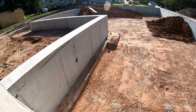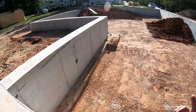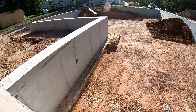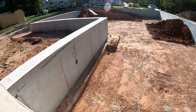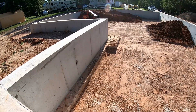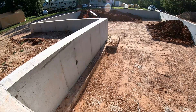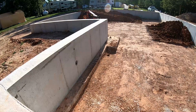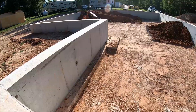And it takes, in this garage that I just worked on, 45 minutes per round. Well, this is three times bigger than the garage, so that means that we're looking at over 2 hours just to do one complete round of compaction in here, and we got to do it five times. So, yay. I'm pretty sure that I'm going to get sick of this just as quick as y'all are on video. So, I don't know how much of it I'm going to record.